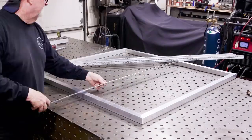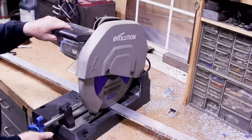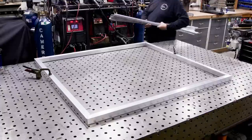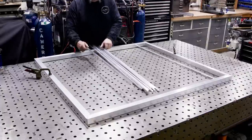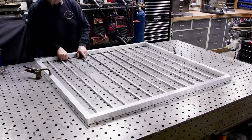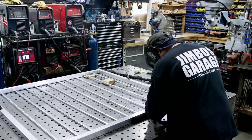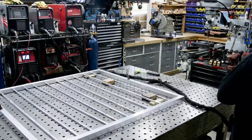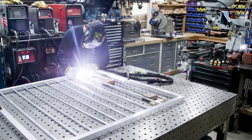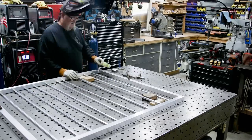The pickets are half-inch solid square aluminum bar. Cutting four at a time, I need about 11 or 12 pieces. Laid them out to make sure everything fits. Starting to weld with three-and-three-quarter inch spacing between pickets. The disadvantage here is you can only do one at a time, so every single picket means moving the foot pedal to the other side of the table.